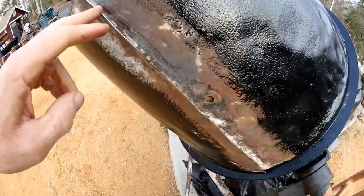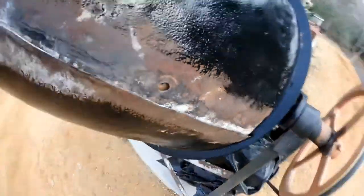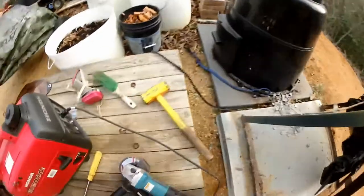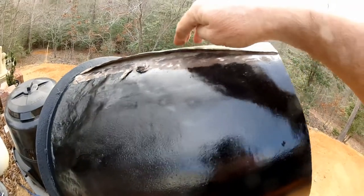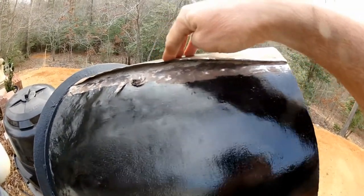It's got three pieces of sheet metal folded here, and they're starting to split. I tried cutting them up and beating the hell out of them with a three- or five-pound hammer. I didn't make too much success, so I think I'm going to have to try to put some rivets in there and draw them down tight enough so I can get a weld on there.